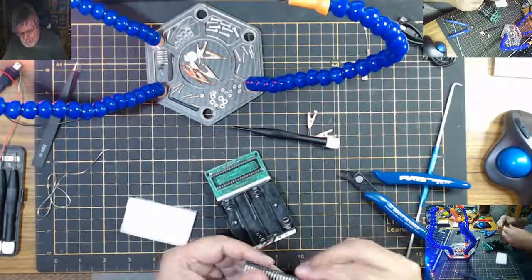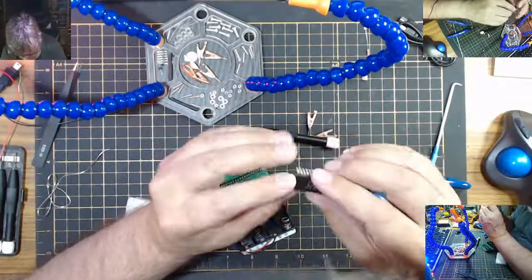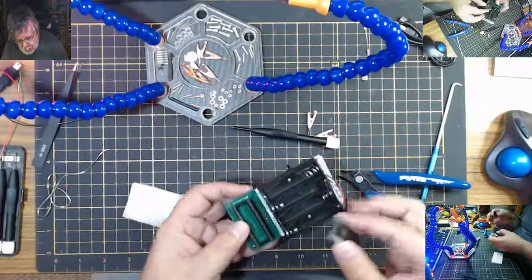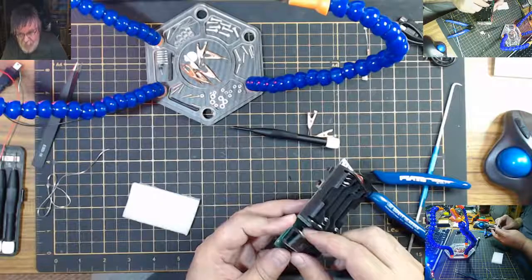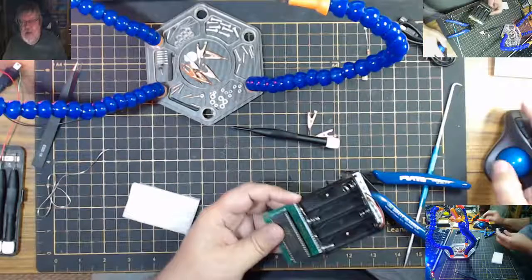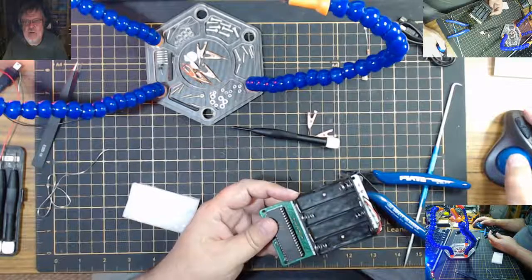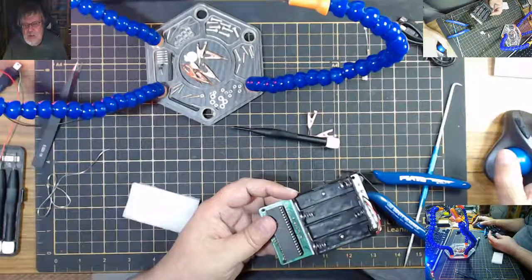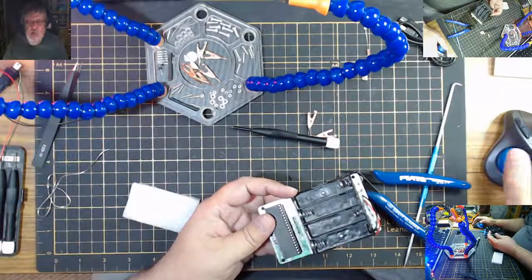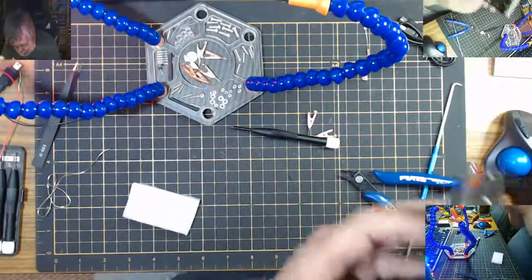Okay, so here's our chip. Let's just check all the pins. Looks good. And we need to find pin 1 on here. The notch is there. So on our board, the notch is this way. So now they had another picture, so let me just go before I press everything in. We scroll down, the back side. Of course, they would have a picture of the board with the back side, and the chip has no label on it.